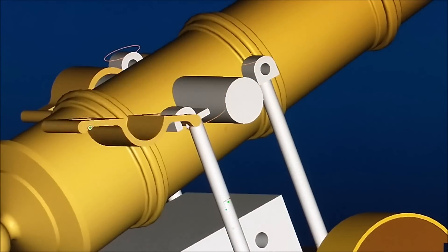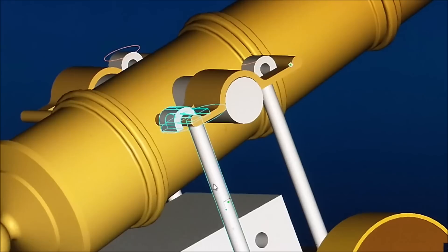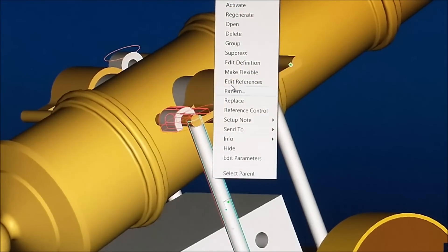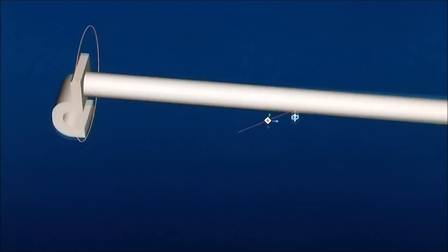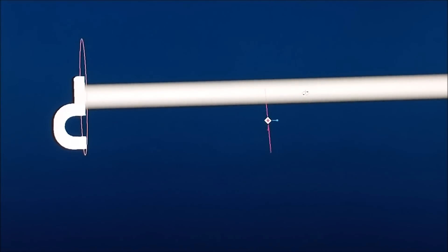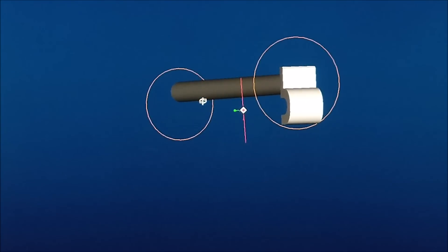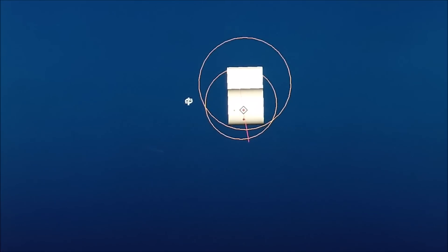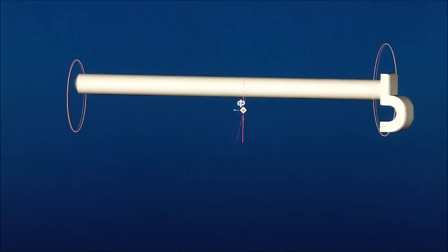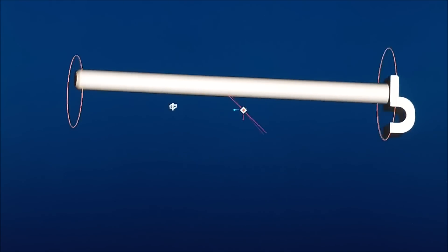It is the hinge point that allows the installation, removal, and repositioning of that little barrel. When I first opened this piece up I thought yeah, it's no big deal, it's a hook — let's go. Here's what it's going to look like when it's done. If I were to do this from a completely round bar, that large circle is almost five-eighths of an inch — 0.625 — a considerable diameter when you're going to end up with just a three-millimeter or one-eighth inch diameter projection.